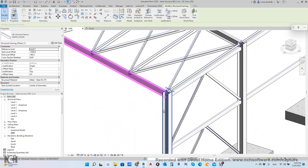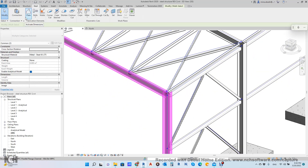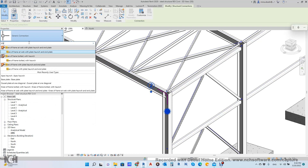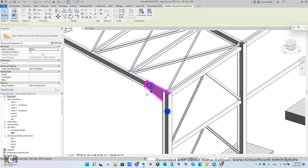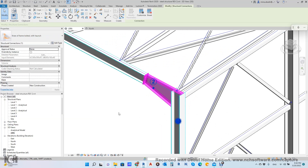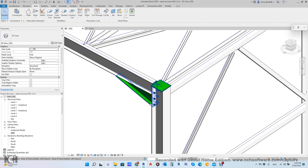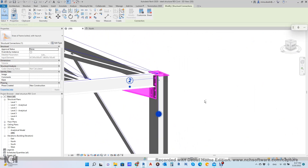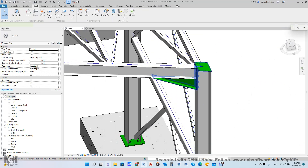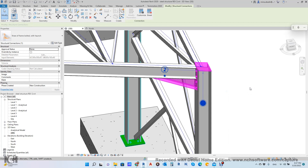This connection is called Knee Connection. Go to Steel Connection and use Knee. We have so many knees in the project. There is one knee I don't like, but there is another knee I prefer as a designer. You can choose whichever you prefer. Then right click and Propagate. When it turns blue it is calculating; when it turns black it has finished.